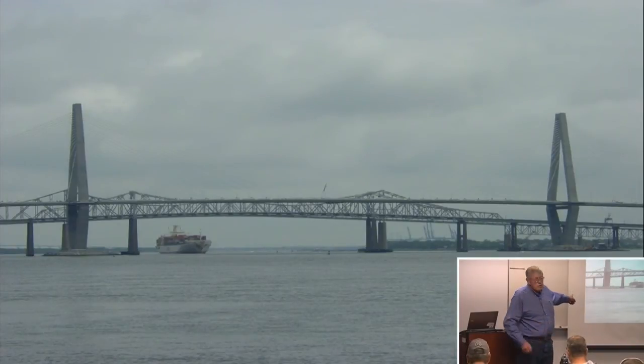These have 11 drilled shafts, 10 foot in diameter under each tower, 230 feet long. They have 14 number 18 bars vertically, and number 8 bars on 6-inch centers for hoops. And there's like 700 yards of concrete in each shaft that was placed continuously. Center of the span is 200 feet over the river. The bridge is 14,000 feet long with about 4 interchanges within the project.